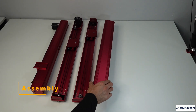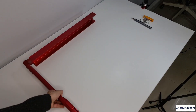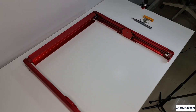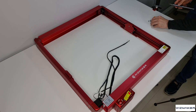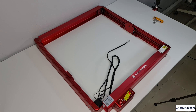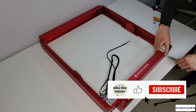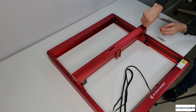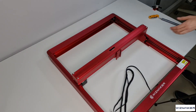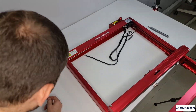Starting with the assembly, the machine comes partially pre-assembled and it's very simple and fast to put all the pieces together. I suggest laying down all the profiles in the correct position and orientation, then simply sliding the profiles and screwing the 16 fasteners. The gantry is the easiest I've ever installed in any laser engraver — all you need to do is place it on the Y-axis trolley and screw four fasteners. Finally, slide in the Y-axis synchronous rod and plug the wiring, which is also straightforward.